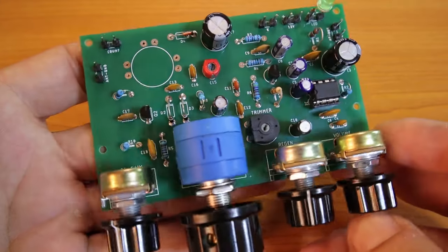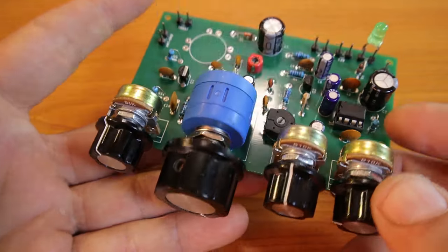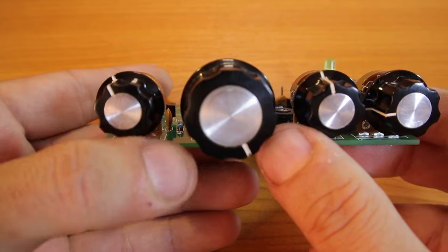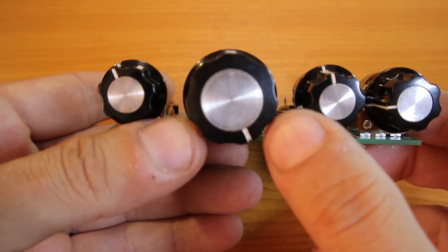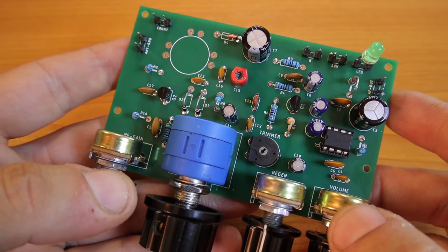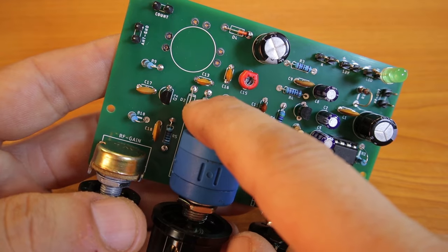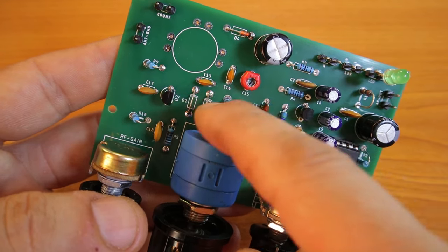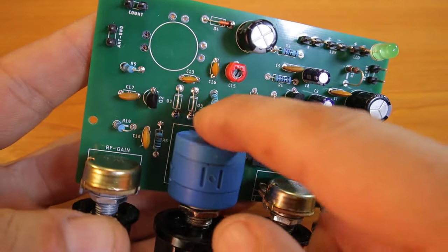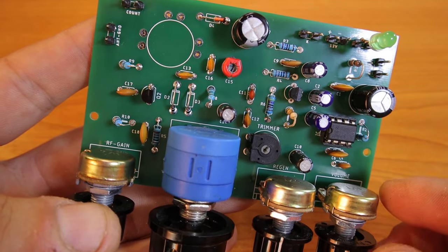The receiver is done. I transferred all the components from the older PCB to the new one — everything fits perfectly. I put the knobs on to check they fit the front panel and left a little extra space for a bigger knob if needed. The only difference from the schematic is the diode. I usually use 1N4001, but you can experiment with diodes to get the capacitance you need. I left space for two diodes since I normally use two 1N4001s.